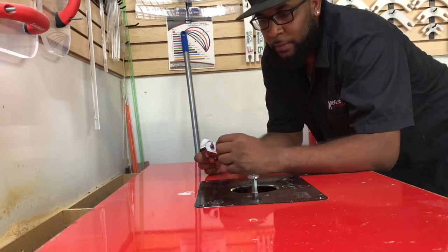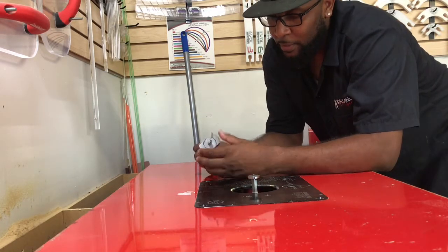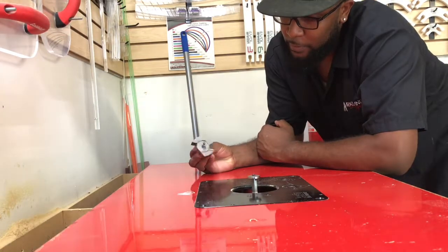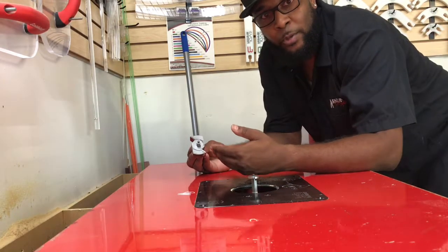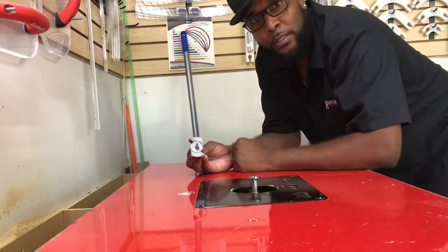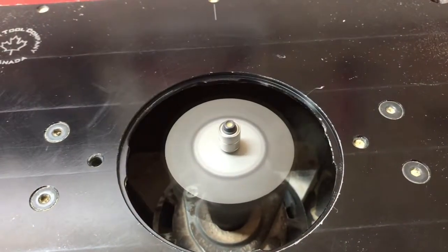You might notice the black ring on this bit — I didn't burn it, this is actually a Sharpie. When the bit starts to spin at router speeds, it creates a visible ring. It's a visual representation of how far you need to go in, step by step, so you don't just plow right into the cut and potentially create a dangerous situation.